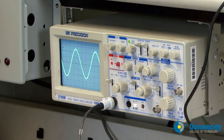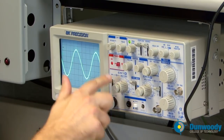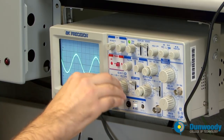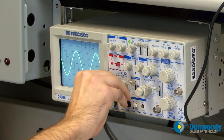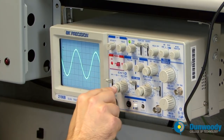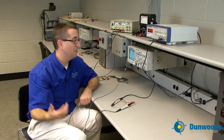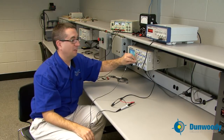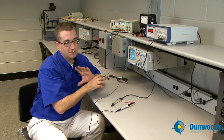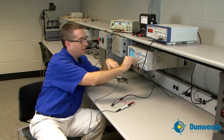There's also a calibration detent on your volts per division for both channel one and channel two — a little detent called the cal terminal. Adjusting it moves the trace, but the only way to guarantee your volts-per-division markings are accurate is to have that cal knob in the detent. Always keep it in the calibrated position for time per division, volts per division, channel one and channel two. If your scope is slightly out of calibration, you can adjust it against a known circuit using this cal terminal.